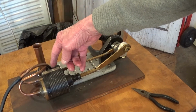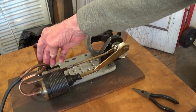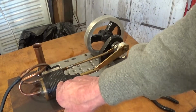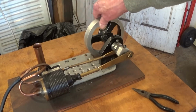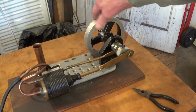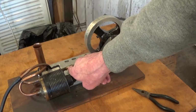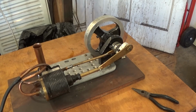The steam comes in there, the spool valve opens this pipe to this one, and sends steam into the cylinder, which then pushes the piston like that. Then it closes off the steam port and it opens up the exhaust port, and I had a big problem, because on the spool valve you've got a slot, and I had big issues getting it timed to run. I really did. And if you go back and look at the playlist, you'll see.